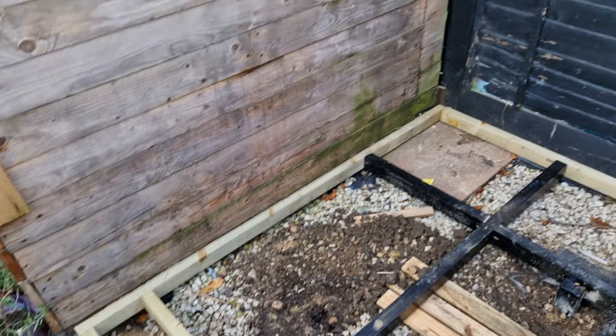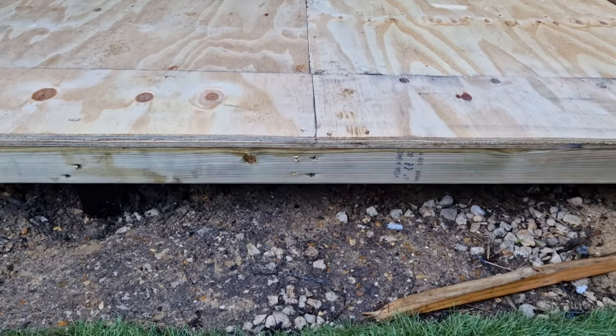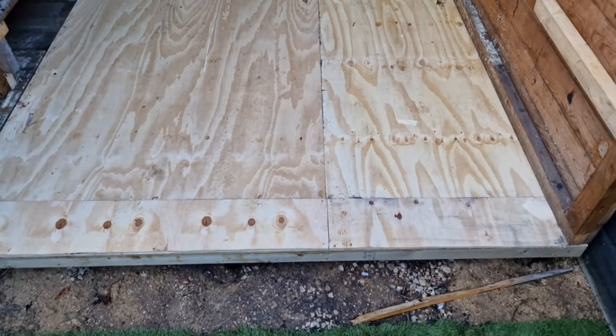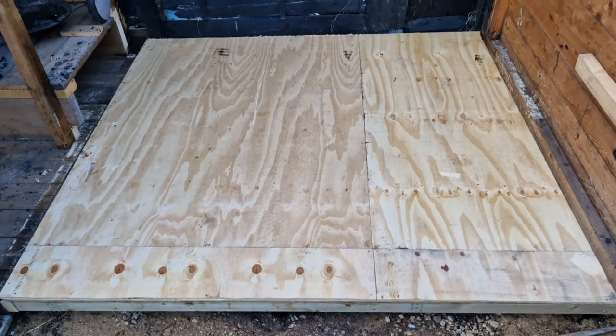Or off of the original shack on the other side. I forgot to take a shot of once we'd just got the floor down — so it's double-skinned and then everything will lap over the front of that. We've done it so that one lot is lengthways this way and the other is lengthways across, so that there's less play in there.